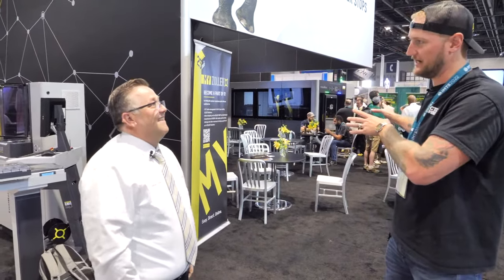Who's putting a system like that on their floor today? Big aerospace, big automotive — all of those guys are looking at this because finding people to do this work is hard. That's the flavor of our environment right now. We're able to actually reduce the amount of labor needed to do this work, and we can do it lights out — and it's more consistent. The first tool of the day takes about 12 minutes for the cooling cycle, but after that we're spitting a tool out every two minutes — shrunk, preset, balanced, done. Somebody picks it up or the robot takes it to them, puts it in the transporter, and the transporter takes it where it needs to go.